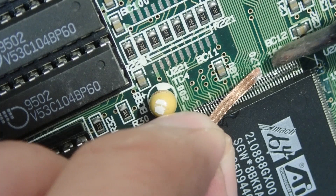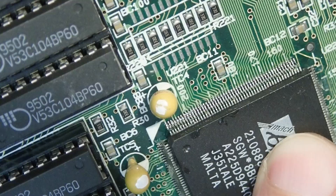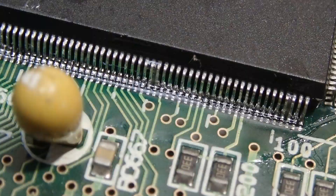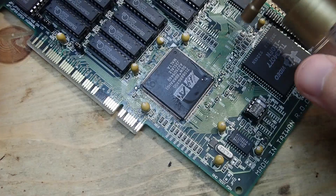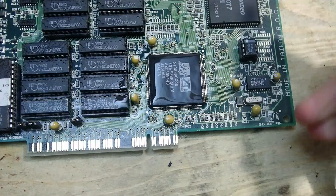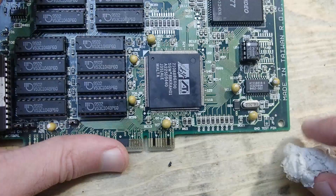When needed, you can try to go over the pins one last time now without any additional solder on the iron tip. However, don't overstress it, since high temperatures can damage the pads on the PCB and this would be a real problem. Repeat the whole procedure for all sides of the IC where you found loose legs, or simply do it for the whole perimeter. The whole operation is also called solder reflowing, or just reflowing. After you are finished, don't forget to remove all the flux using some alcohol, since flux can be conductive and with such tiny spaces between the pins it will definitely produce a lot of problems.